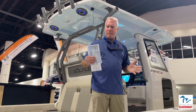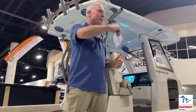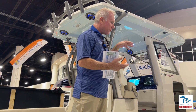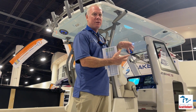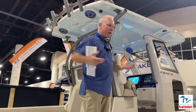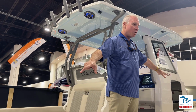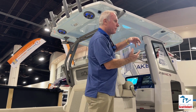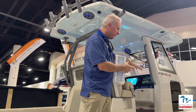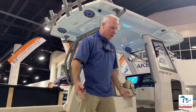So the way we manufacture this boat is a little different than the rest of the boats. This boat is actually manufactured so the hull and deck come together mold to mold in lamination, and it's parted out of the mold with its deck installed. So it comes together precisely with glue everywhere, down in the fish boxes, around the edge, on the sides.